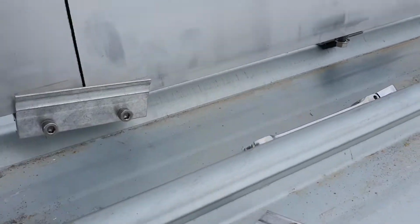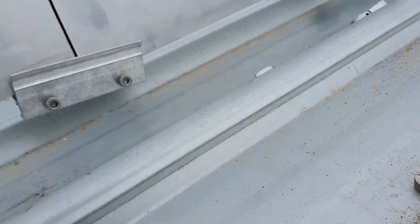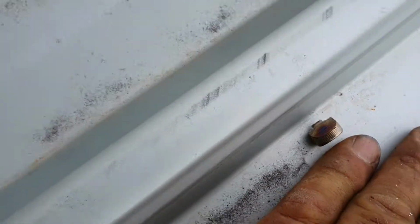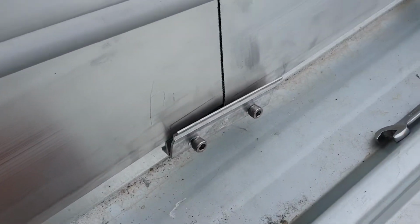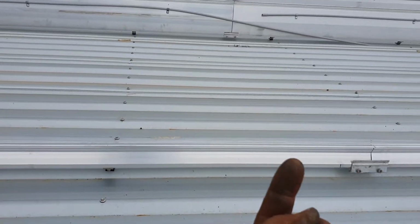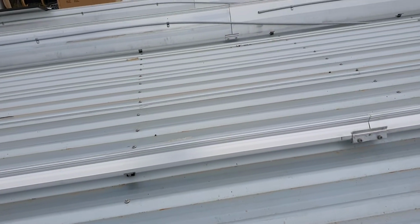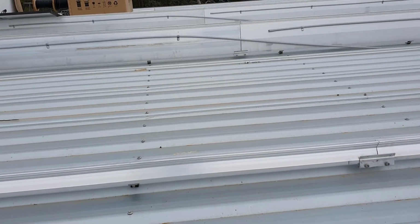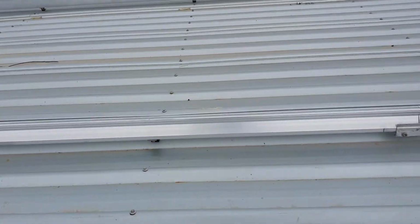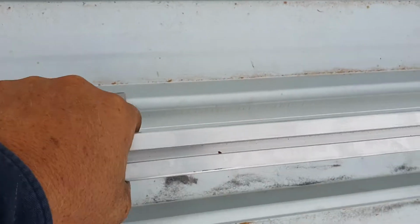And I've had to cut the first one off because trying to get it in the slot caused it to seize, so that got ground off. Right, so now I've got to get this one in, because this stuff is not adjustable. You've got to slide the nut all the way in along under the rail to the right spot to locate it. And they've got a better solution called Rapid SML, which is just as good to go horizontal, or should I say 90 degrees perpendicular to the ridges, because that will rock probably even less than this one.